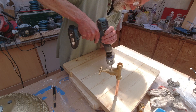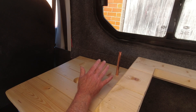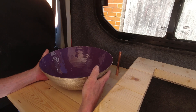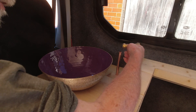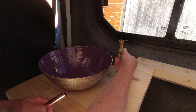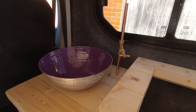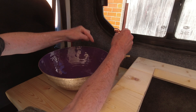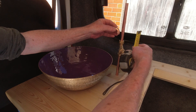So we just want to take this out. The next thing we want to do is get everything in place and then see if we can make the tap. The bowl is going to sit there — I've tested all of this and it is watertight, all good. We're going to put a bit of pipe out on the top and put an elbow on here, a piece of pipe this way and a little piece coming down. So we just want to measure all of that and cut these pieces of pipe to size.